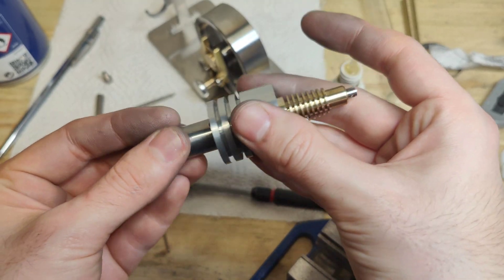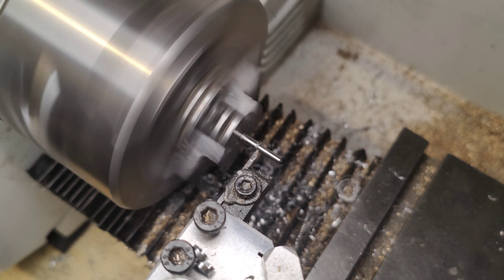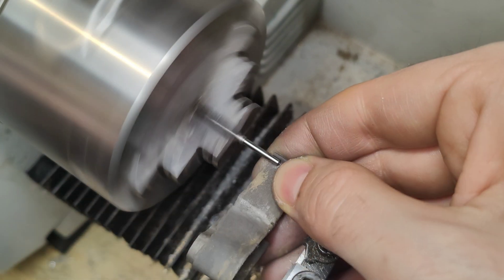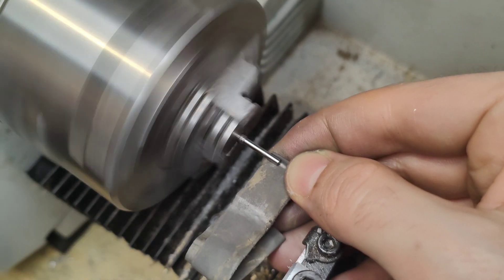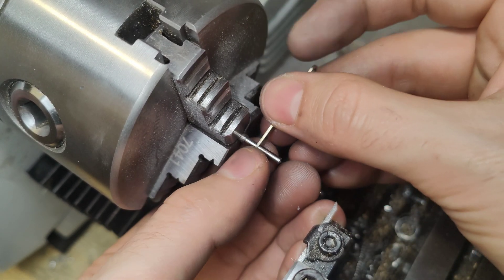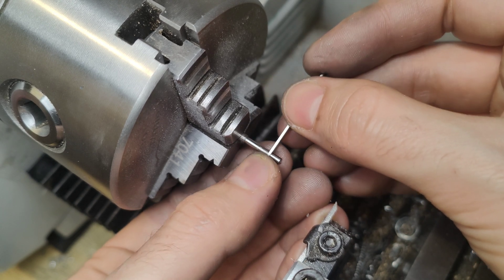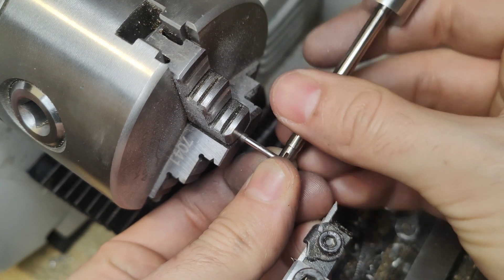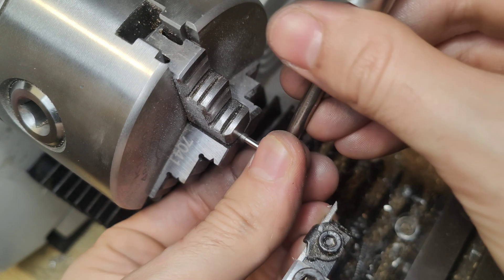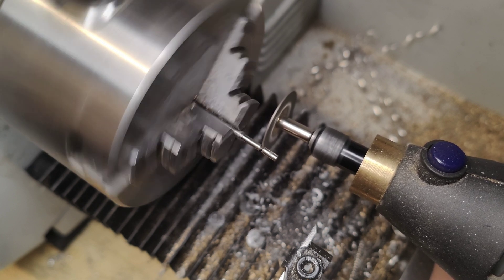Here I'm just testing if everything is airtight. This part is really crucial — it's a tiny pin which sits between the piston rod and connecting rod, and this pin has to be really tight. If this piece is a bit loose, the engine will make noise when running. My goal is that this engine runs really quiet so you can't even hear it, and for that reason every part has to be really precise with not much room to move around.